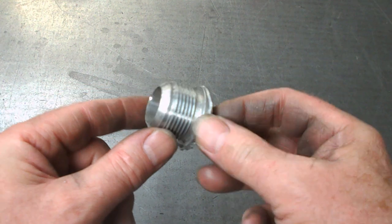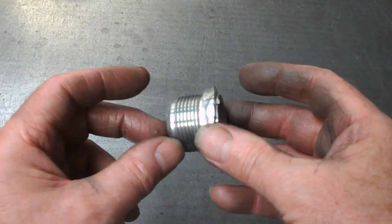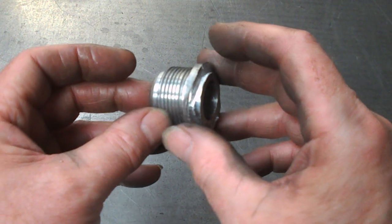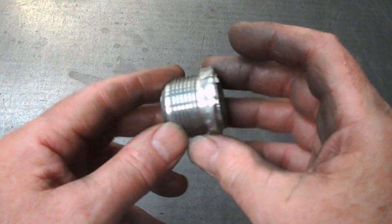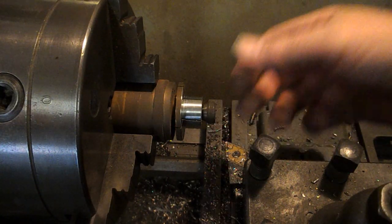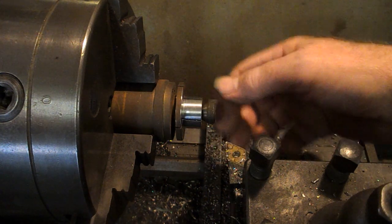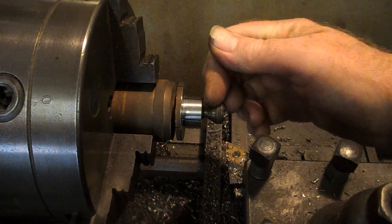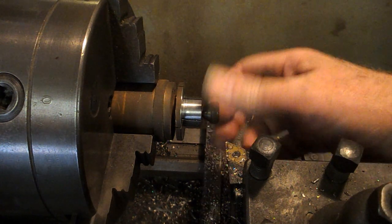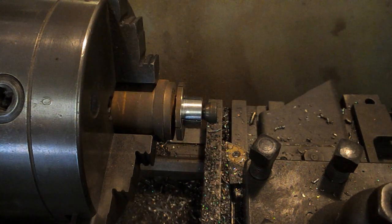In order to hold this, we have found an old homemade kind of an expanding collet, which is a little bit of an adaptation. It's going to do the job pretty good. This is the mandrel that came when I bought one of the other lathes that we've got - it's a homemade affair. The back side of this screw has been turned to a taper, with a corresponding taper inside, so that when you tighten it up it expands the thing to grip the piece that you're putting on it.